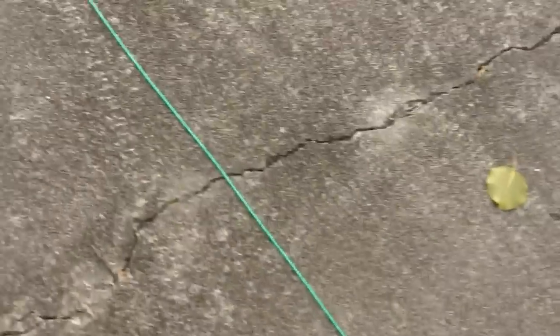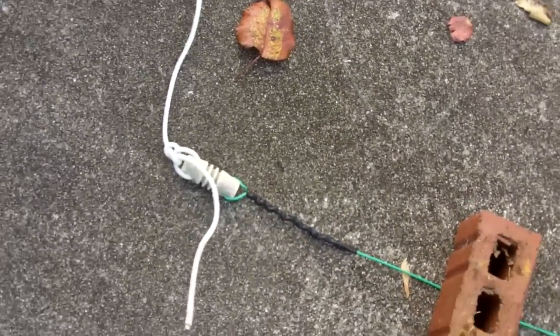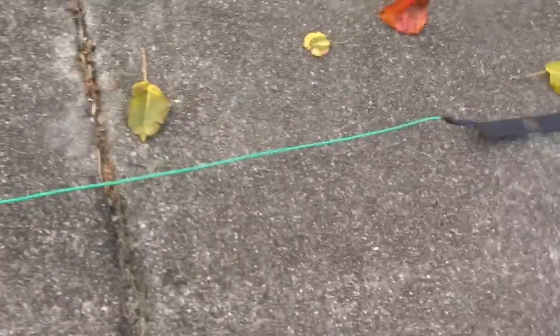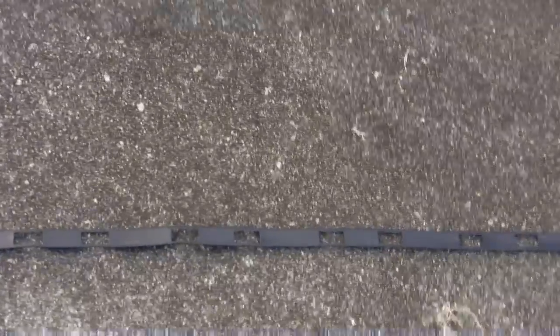At the end there are bricks just to hold it down, a little PVC insulator at the end, and then you tie your rope to it so you can hang it from a tree limb and just let the weight pull it vertical. The ladder line, which is 8 feet 2 inches, can be found at a ham radio outlet or on the internet.